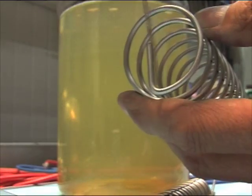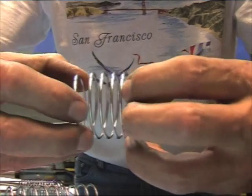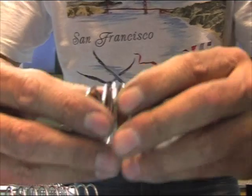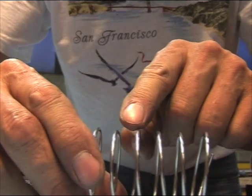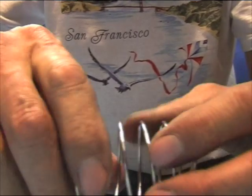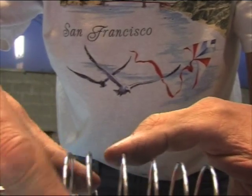Like this one here — one twelfth of an inch thickness. It's all bent up and it goes back. Then you take it in the middle a little more, on the side a little more, here a little more, until you have the size you want. When the diameter is not the same, you see there is a difference in height — then you go and you just twist it, twist it back like this. You hold it and then it opens or closes again. The thin thread is not easy to close, it's easier to open.